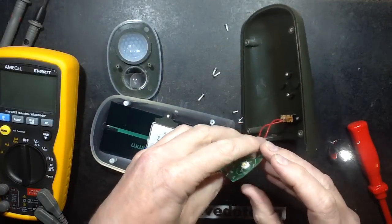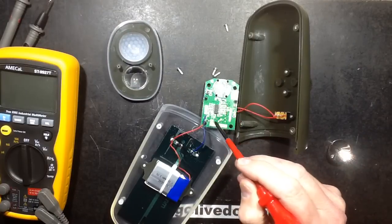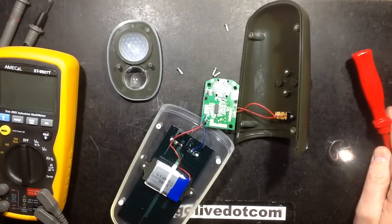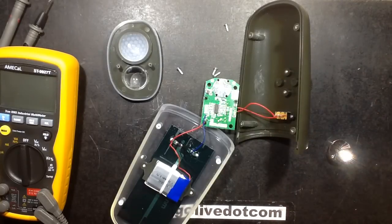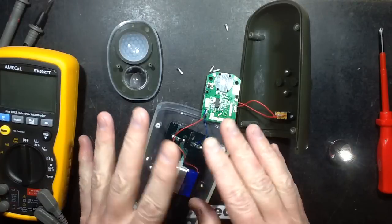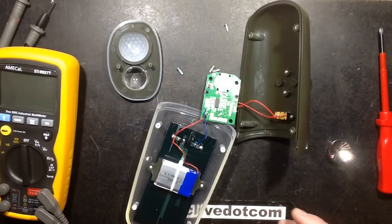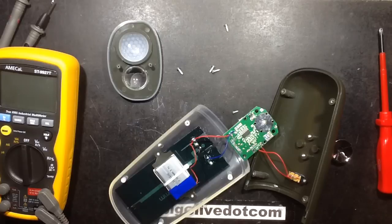I've done a little bit more investigation. I thought the LED was being fed from that regulator because it was in the vicinity, but the LED is actually being fed directly from the battery output via the resistor. So as the battery reaches a fuller charge it will actually drive that LED at a significant current — potentially up to the full 3 watts. But as the voltage of the cell gradually goes down from 4 volts down to 3, the current will steadily decrease — 2 watt, 1 watt, less. Technically, after a long period of continuous operation it could still be putting out light, but not anywhere near as much as when it started. They're shuffling the truth a little bit, but I don't see this light being actuated continuously all night long, so I think it will do quite well — it will reduce in output intensity, but that's not such a big deal.